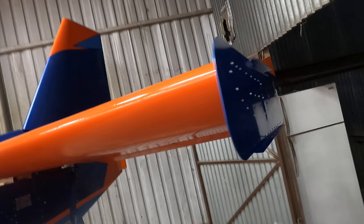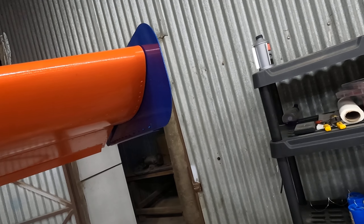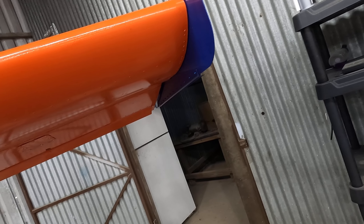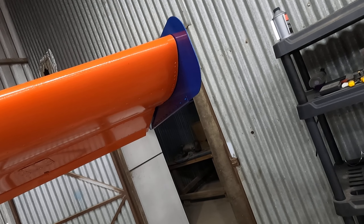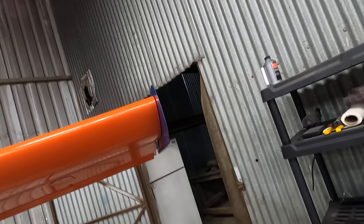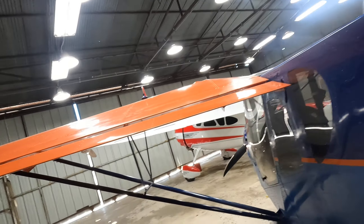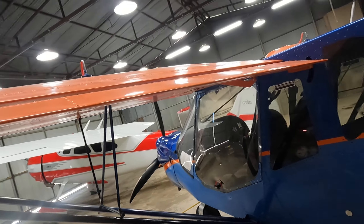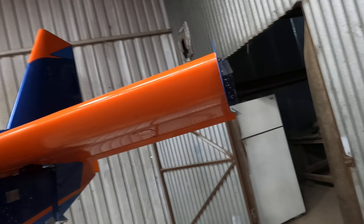That's the install. It takes more time to paint it than it does to install it. I think it looks pretty good. They definitely work — they take about five miles an hour off the stall speed when the elevator loses all the authority. As long as the prop's turning, it's really good. I did notice doing an idle-to-power stall that I get so much prop wash from the big prop sitting out in the wind, basically creating a gigantic board out front, that it just makes everything rumble. You can tell the elevator stops working when it's just blocking all the air — if you're not getting any air over the horizontal, it's not going to do anything. But so far no issues with it — it does help.